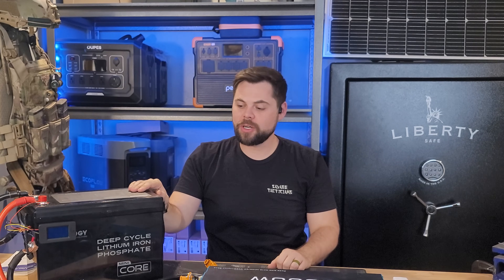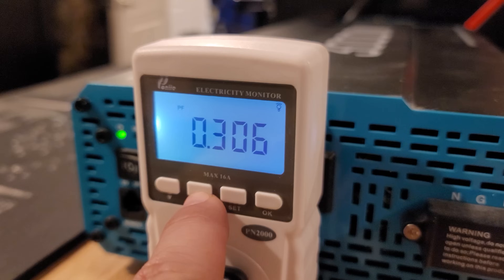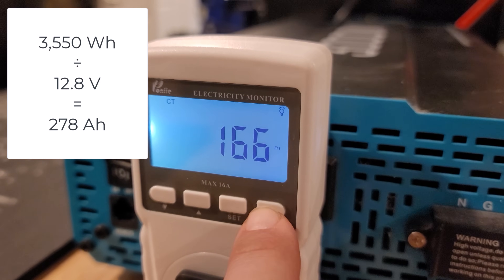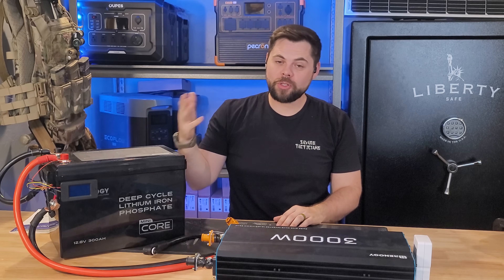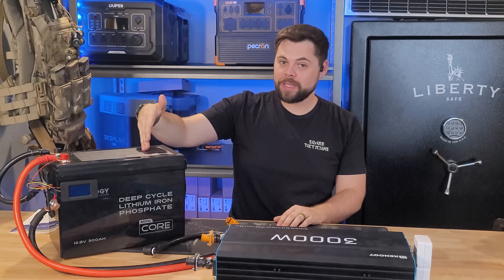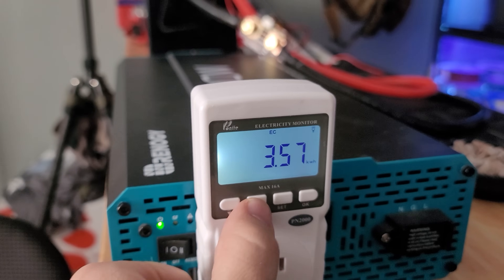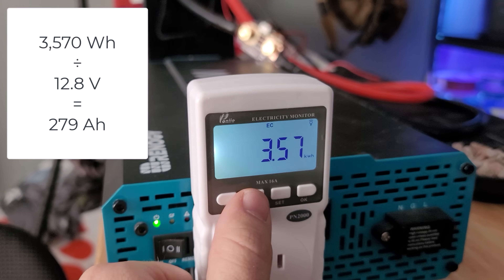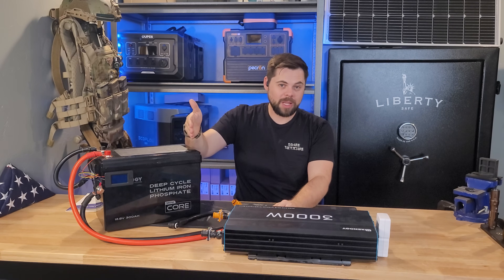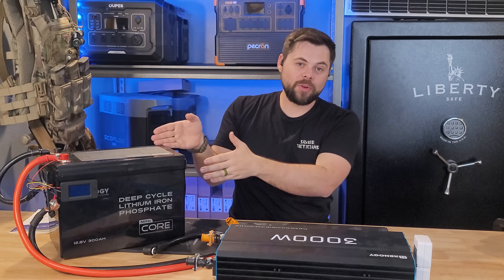As I was doing this test, I kept consistently getting 280 amp hours out of the battery instead of the posted 300. This was concerning because a lot of other YouTubers have found battery manufacturers being outright fraudulent about capacity. I was very surprised to see that could be the case with Renogy, so I reached out to give them a chance to explain. They assured me it was indeed a minimum 300 amp hour battery — and I thought there's probably a chance, because as you convert from DC to AC power there's a conversion loss: a percentage of that energy gets used up as heat in the conversion process.